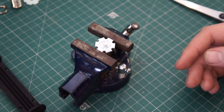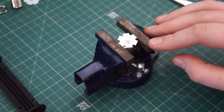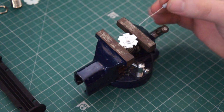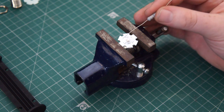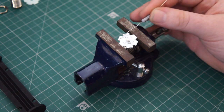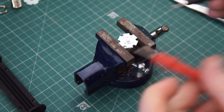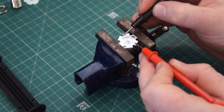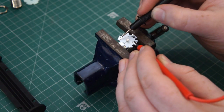So you've got your LED here and what we're going to do is tin the pads. You'll notice on the LED it has four pads — two labeled plus and two labeled negative, opposite each other. You've got positive, negative and positive, negative. You can solder either one; they're both exactly the same. For example, if I apply positive and negative voltage here — there we go, you see it lights up — and I can do it on the other side and it lights up as well. So there are two different pads; you can choose either or, it makes no difference.